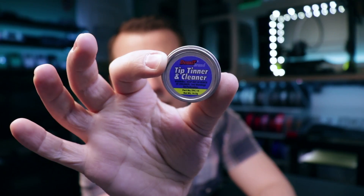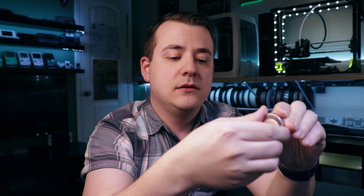Another thing to take care of your tip is tinning it — that basically just means putting a very thin layer of solder across the whole tip, which can make it a lot easier to work with and also make it last a lot longer if you remember to do it every time you're done using it. You don't need anything special to do this per se, and there are a lot of good videos out there for how to do it. But if you're lazy like I am, this stuff is fantastic — you just kind of stick the tip in there and it'll tin it for you, nice and easy.